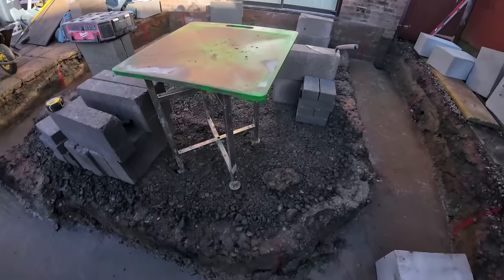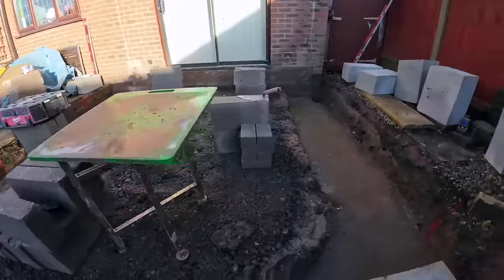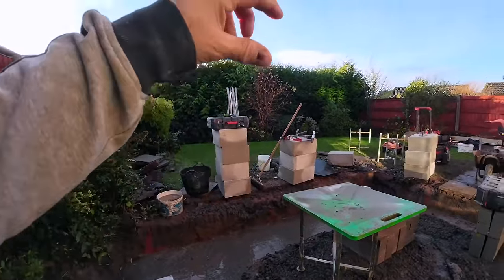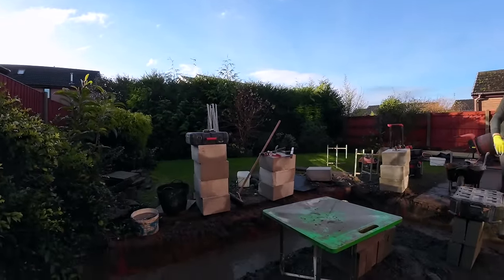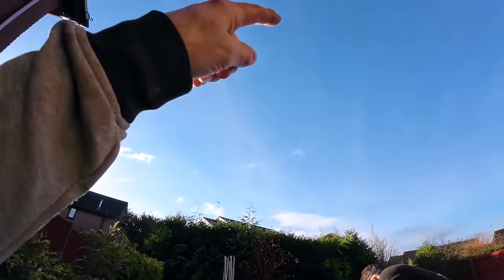The main reason we've done the front is the extra room, plus it didn't work brick. We had a three-quarter in it, and the reason we didn't want a three-quarter is because we've got a window in this, so we've got a panel underneath the window, and then we've got a pike above, or gable as some people call it. We didn't want a three-quarter all the way up, because you've got to put your three-quarter in the middle, so it goes right to the top of the pike.